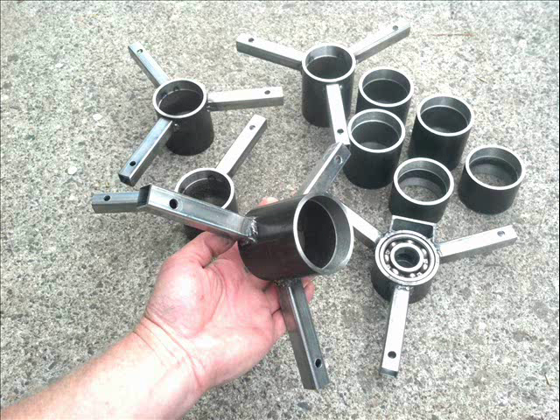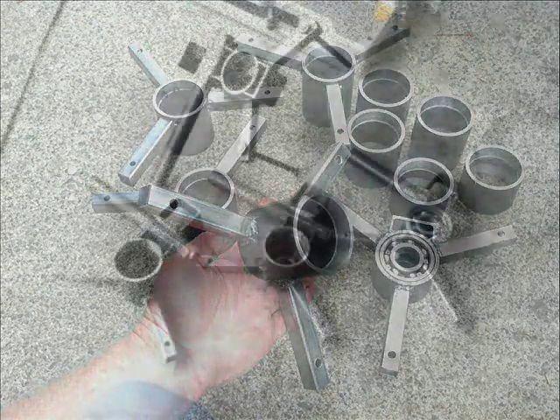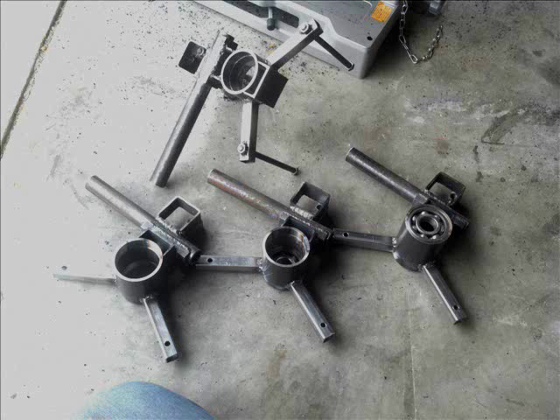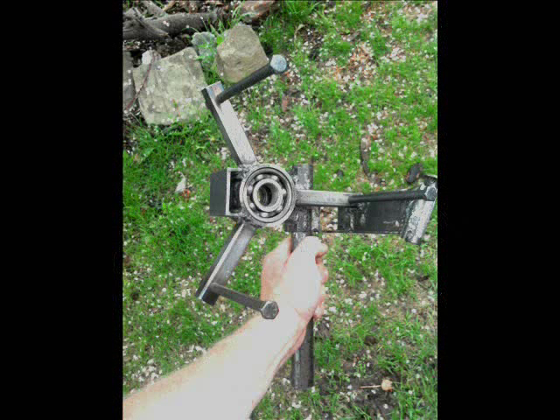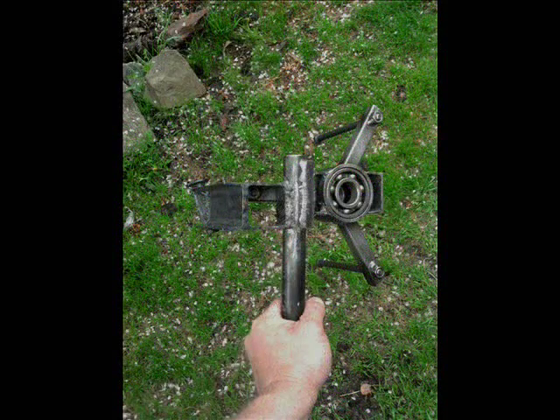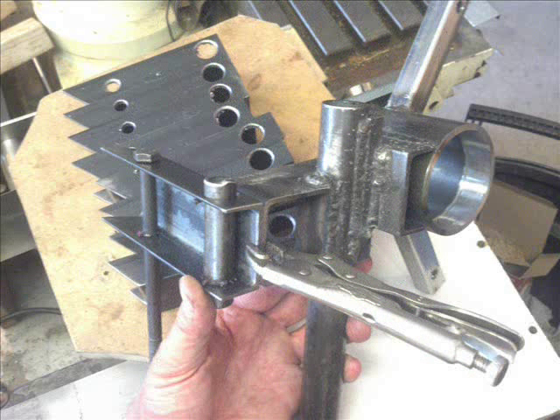These pictures came from the Belgrade machine. The main conclusion is everything needed to be bigger, and we needed a furling mechanism. So we're going with 7-inch magnet rotors, bringing the magnets out even farther and the coils out farther, allowing more room for more turns on those coils. This is the back side of the machine where the rotors and the stator go. If you look all the way to the far right, you'll see where the furling tail mechanism starts. This is the front of the unit — notice that the grease caps have been removed on the bearings so he can do welding and keep everything in shape. This last photo shows the first part of the new furling mechanism design. I'm Scott Brown with Green Wind and other Home Energies. Many good things to you and thank you for watching.